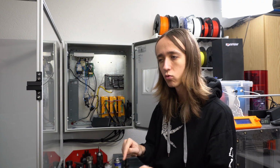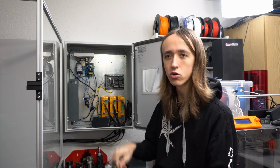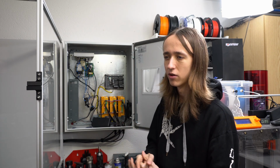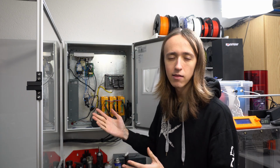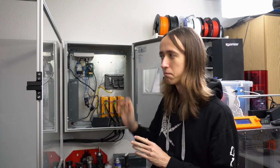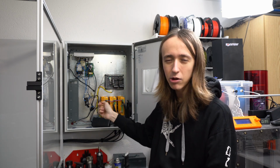Now, ideally, instead of in Fusion, I want to set that I want the spindle to turn on, and I want it to turn on at 1500 RPMs. But getting there is quite a challenge. Now, emulating the switch that changes the direction and turns on and off the spindle is fairly simple with a couple of relays. But the potentiometer, well, I could probably figure out how to emulate that as well.